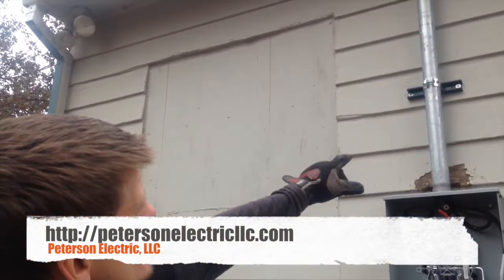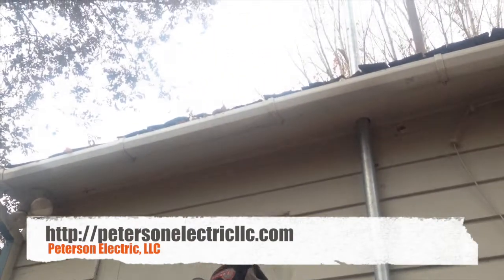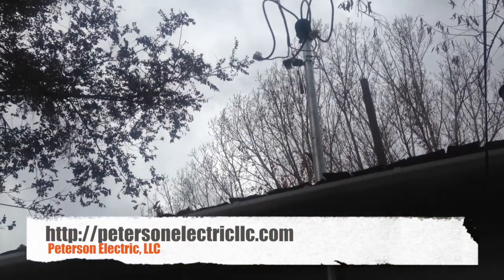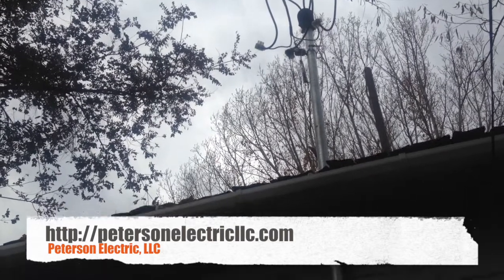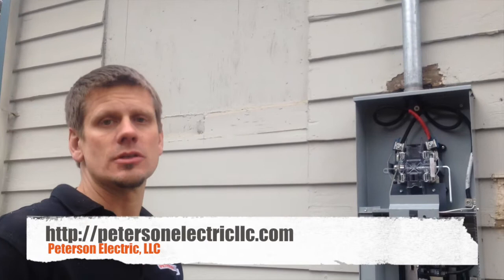That's a 2-inch IMC or GRC conduit, and pierced through the roof. Used our roof jack up there. Used our clamp for our guy wire, as well as our conduit strap for our overhead service lateral, and our couple bug splices. So, yeah, it's pretty much a full day job getting all this done.